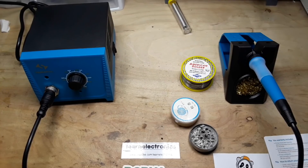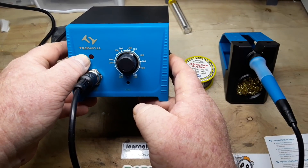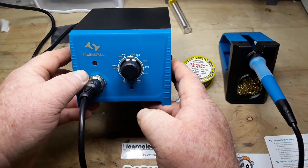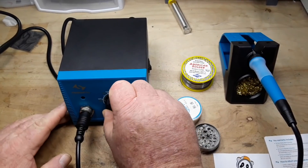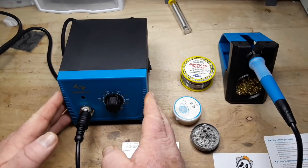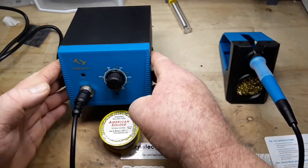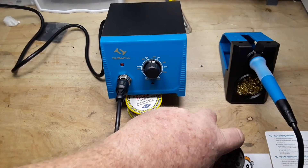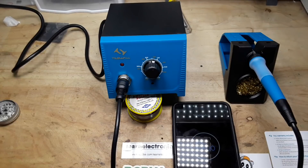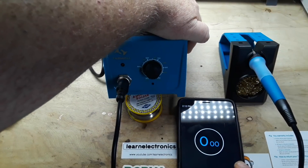The first thing we're going to do is tin our tip. On the front of the system we've got an LED. When the LED is on, the iron is heating. When it flashes, it is close to reaching its desired temperature. And when it's off, it has reached the desired temperature. I like to solder at about 350°C, so we'll see how long it takes to get there. I'm going to prop this up so you have a better view of the LED. Alright — one, two, three, go.